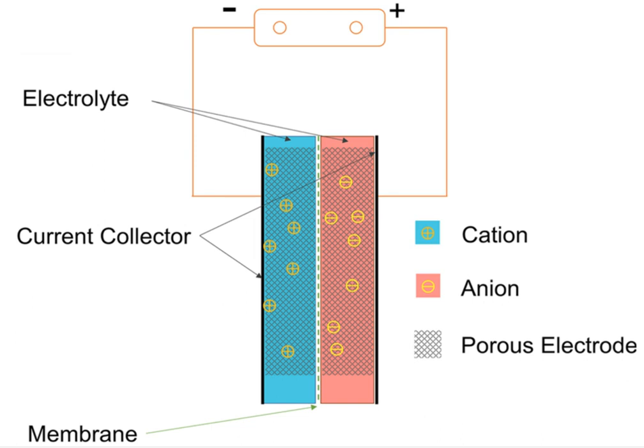Whether the aberration of the parameters has any influence on the proper functionality or not depends on the application of the capacitors. Such large changes of electrical parameters specified in IEC/EN 62391-2 are usually unacceptable for high current load applications. Components that support high current loads use much smaller limits, e.g., 20% loss of capacitance or double the internal resistance.